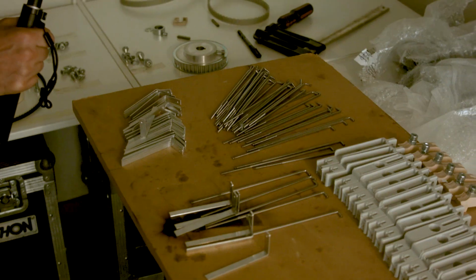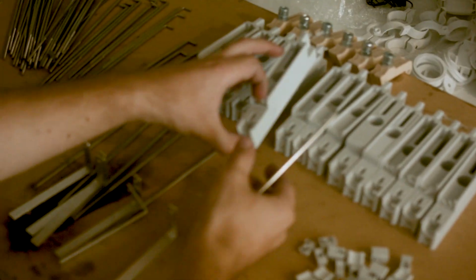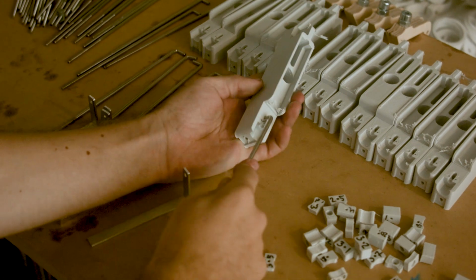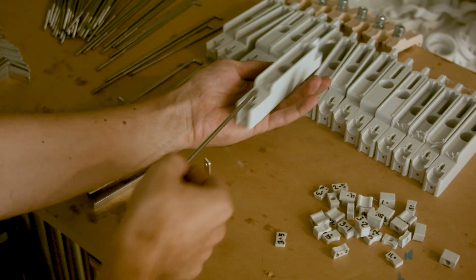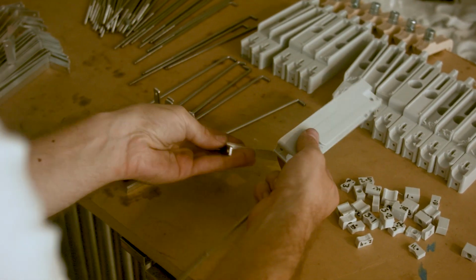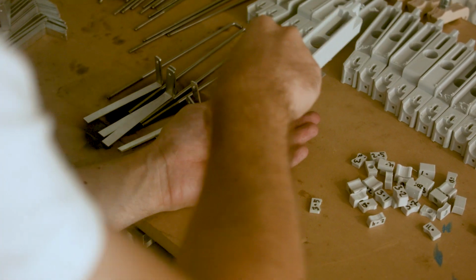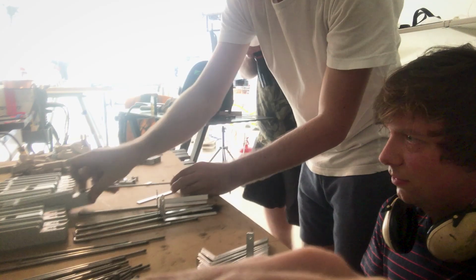But over here, Thomas, you can show us the connecting rods. Okay, so these are the connecting rods that we know from the video. And after some more preparation and some drilling, they will fit in here, right at this position. And they will be attached to a spring that will pull these marble releases. And there are these L brackets that are going to be connected right here, that are going to catch the marbles so that they don't run out too fast. And that's basically this first release.